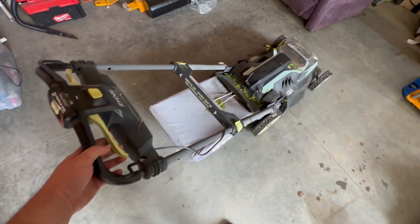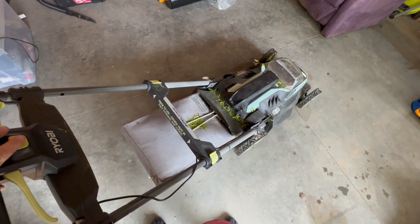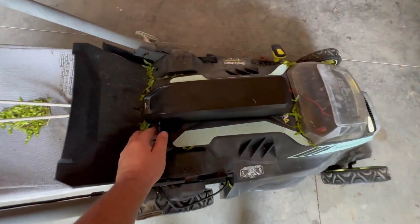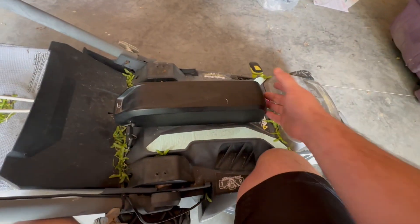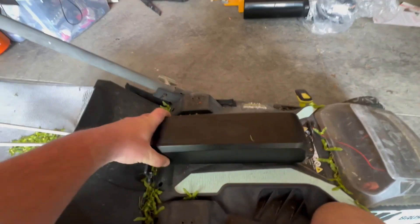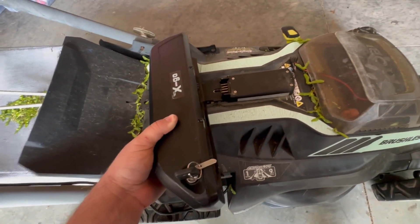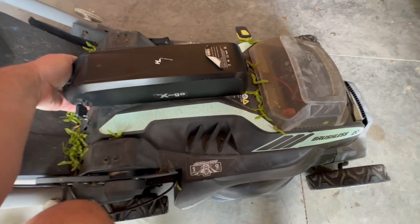Just to show you that it is currently working on 36 volts — we're going to take this battery off and put the 48-volt battery on. The 36-volt battery's top voltage is about 42 volts when fully charged, whereas the 48-volt battery tops out at around 54.6 volts. So it could blow it up. But a lot of the time the 36-volt controllers are actually able to handle 48 volts, and they have caps that are 63 volts, so we can give this a shot.